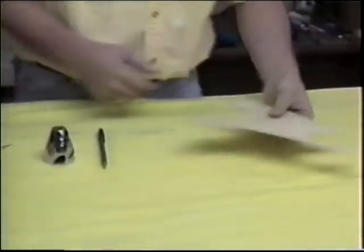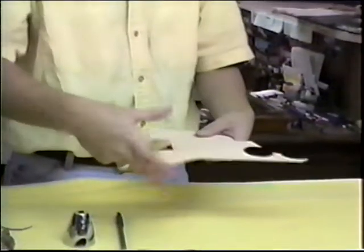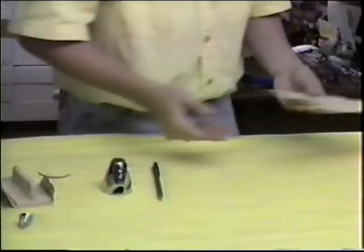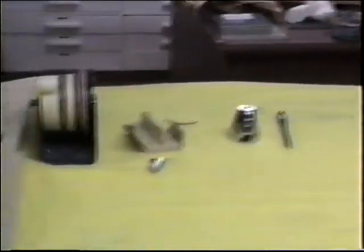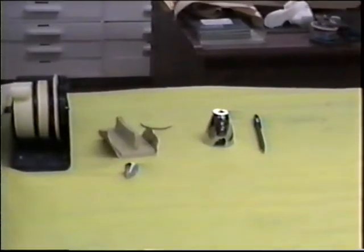Oh, well, okay. And again, we're making it. I was just going to block them out so we had a small piece to work. Yeah, okay, but don't worry. We have plenty of plywood. The thing is to always try to use two pieces of 16th instead of one piece of 8th. You get one extra grain lamination that way.